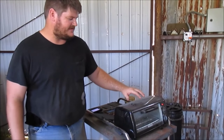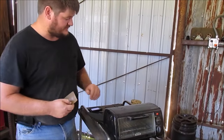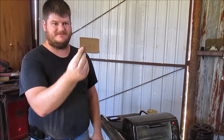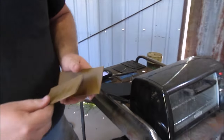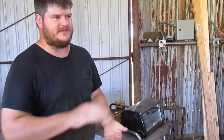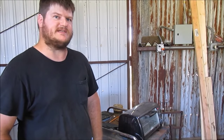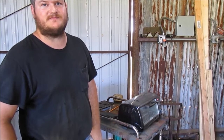For heat right now I'm using a cheap toaster oven from Walmart. This thing is not particularly reliable on holding the correct temperature, so before I throw a piece of Kydex in that I'm actually using, I'll put in a test piece to make sure it's not melting. You can see it's shiny and has the shape of the grill from the toaster oven in it. Some point down the road I'm going to invest in getting a t-shirt press to heat the Kydex from both sides — it's a clamshell design with a digital controller and should be a lot more accurate. It seems to be the go-to piece of equipment to heat Kydex consistently. In the meantime I'm hobbling along with a cheap toaster oven, but that's not a permanent measure.